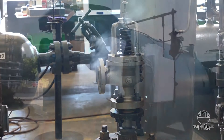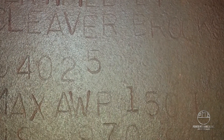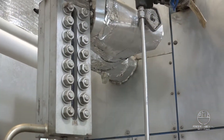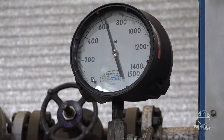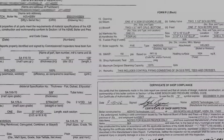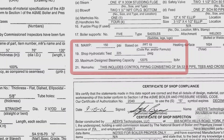Boilers, like all pressure vessels, are manufactured to industry standard specifications and then undergo strict certifications verifying the pressure capabilities of the vessel. Many factors can affect the expected pressure capabilities, therefore each vessel must undergo a hydrostatic test, then is individually certified for its maximum allowable working pressure.